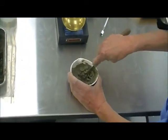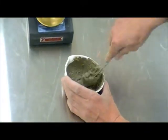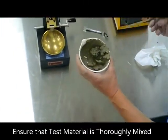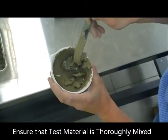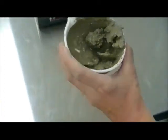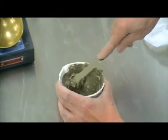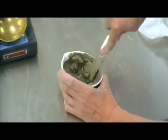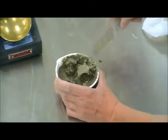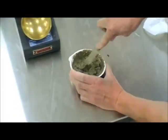You can see the material is sticky. While you're mixing this, it's very important you observe how uniform it is. If we take a close-up, you can see there are some drier spots, and there are some shiny spots which are more wet. When you're ready to test it, it should all be one — consistent material throughout. By feel, you can also tell, because with the spatula, when you're mixing it, you can feel that the material has uniform consistency.